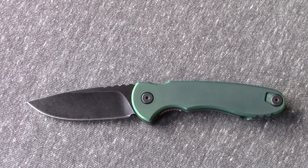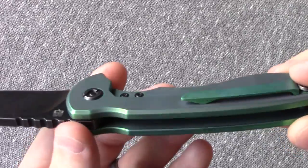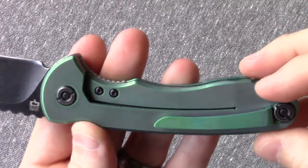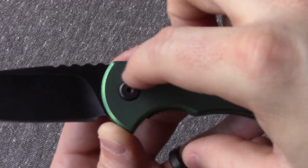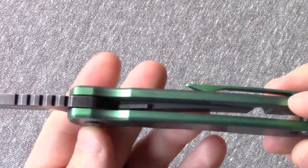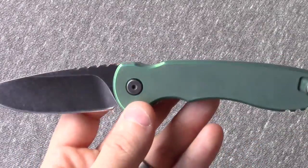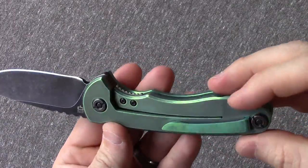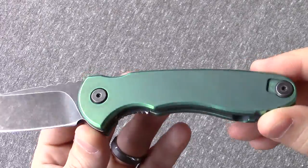Normally it comes in a finish a little bit different than what you're seeing on the handle. When I got mine — this was the Blade HQ edition — it has their logo right on the inside there. It had a stonewashed finish over the handle. I noticed that on the pivot area there were these circles scratching the finish on both sides — that was not very cool. I did contact Quartermaster and their customer service was very good; they were ready to take care of any of my problems. I decided to just modify it myself — I sanded it down with fine sandpaper and did this cool green anodization. Turned out pretty well.